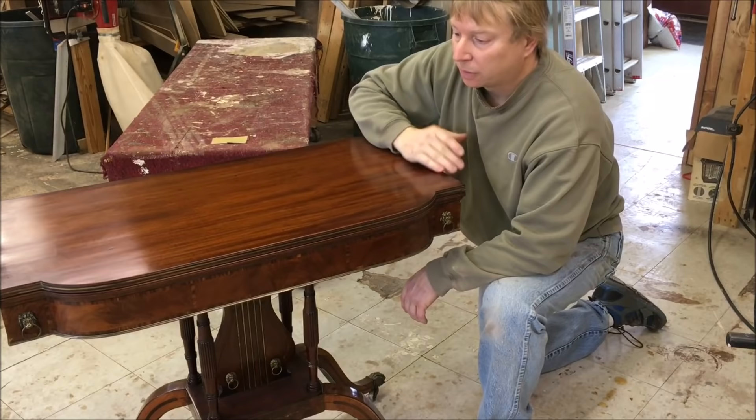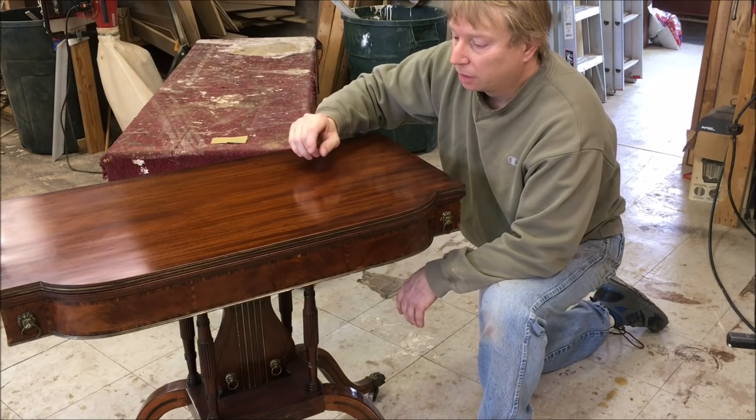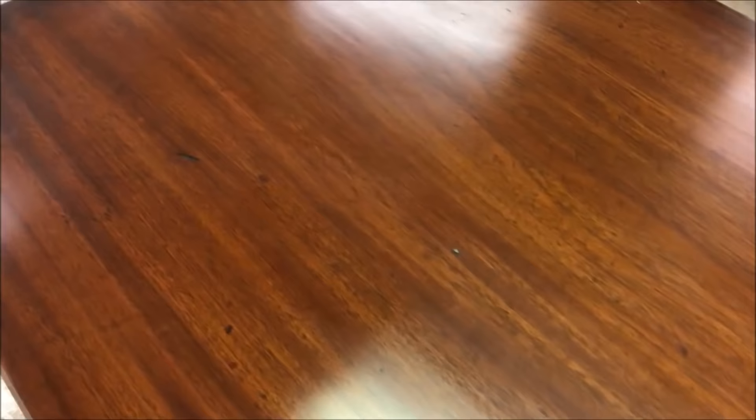And then in this case I did what's called mist coating or dust coating, just to avoid any orange peel of any kind. I did that maybe a dozen times to build up the finish and then rubbed it out. Now the scratches are still faintly visible, but there are other dark spots and dings in the finish, so it all just blends in.